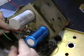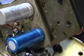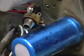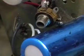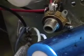What we're going to do with the six-inch ones: the black lead is going to go to pin four on this connector. If you're not sure which pin four is, double-check using a bright light — the numbers are written on the side of the connector. The black wire goes to pin four, right there. Then we're going to take the short green wire and attach it to pin one, out here.